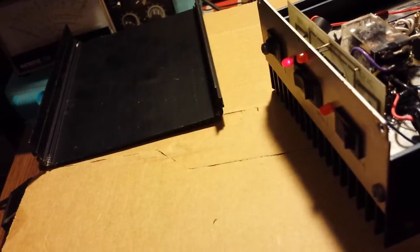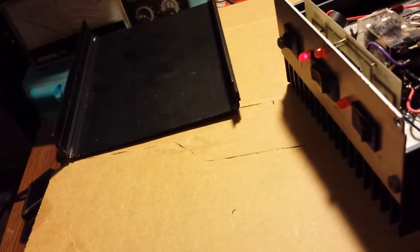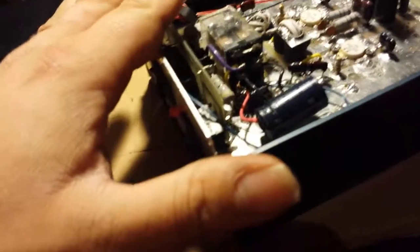If any of y'all know anything about amps, we're getting about 180-190 watts on 15 volts with 20 watts of drive. I kind of would rather drive this amp more — it is set up to be a high drive with four wraps on the input and four wraps on the output. I would like to show y'all that it will do more watts.